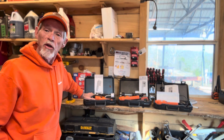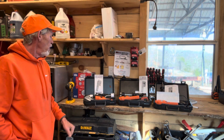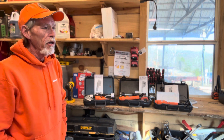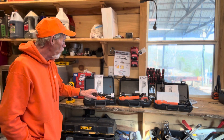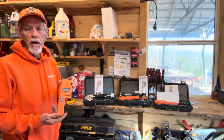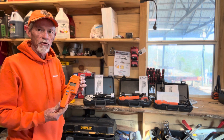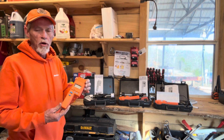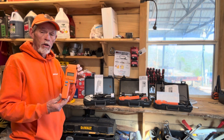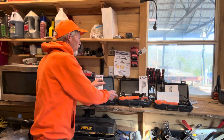I can't speak to the other ones because I didn't purchase them. When we first got started, we got the BD2100 Delmhorst. The reason I got that one was we were doing some other things along with cutting wood at the time, and this one will measure not only wood but concrete, drywall, and a lot of different surfaces. So it's great if you're in a contracting or remodeling business where you need to check drywall for wetness or mold. It will work on wood, but it doesn't have quite the capabilities for wood as the J2000.